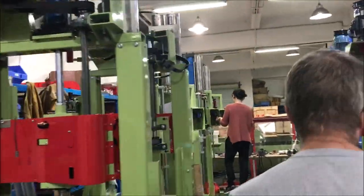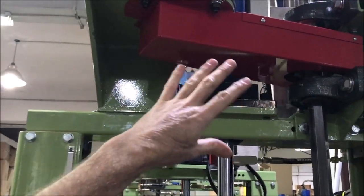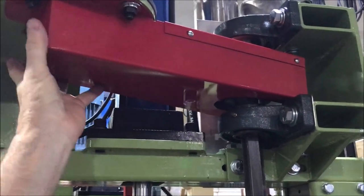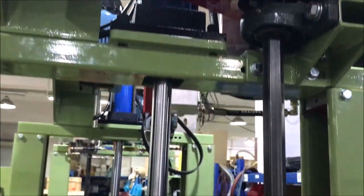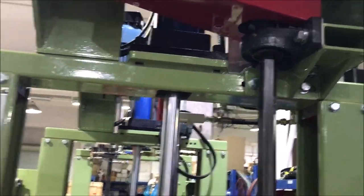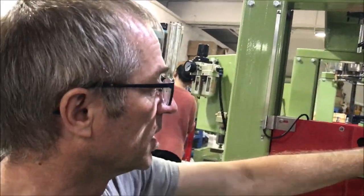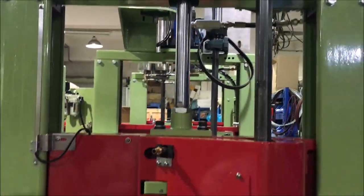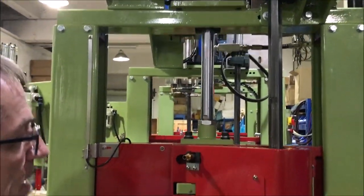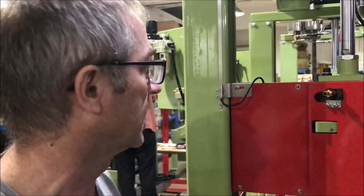This is the completed drivetrain. Basically there's another timing pulley inside, and this guard covers the belt. The shaft is still exposed — it's an industrial piece of equipment. It's not dangerous, but you just don't want to wear loose clothing or have loose hair near a spinning shaft. You should never have your hands in this region when operating the drill or down underneath it. This allows power transmission without making the head really heavy, and it's a simple mechanism for producing really consistent cutting.